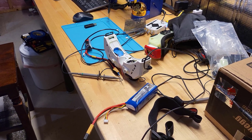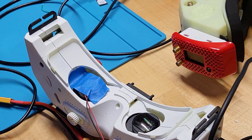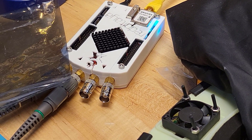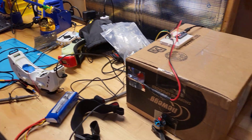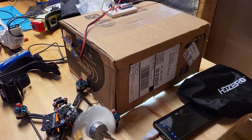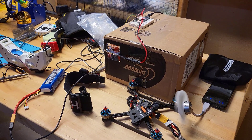So what are you doing, Jeff? What is that? It's a photo diode. It's going to measure the light coming off of the goggle screen there, and that's going to this — an oscilloscope. That's going to measure the signal coming off the photo diode as well as the trigger of the light source. And what's this over here? Torture box. That is flashing a giant string of LEDs on the inside just to make sure you've got pure darkness and then abruptly pure light on the image sensor.